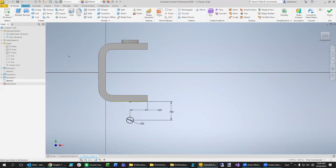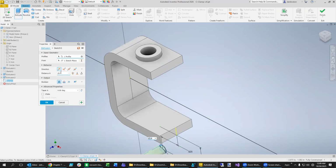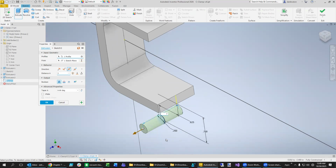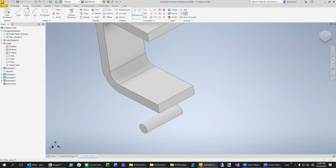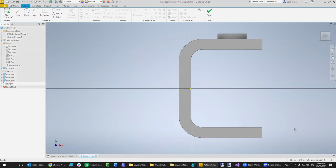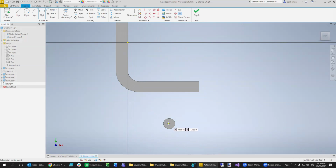We will do an extrude of that tube, that circle. It needs to be bidirectional. It needs to be 1 inch. So it's directly below this. So we put our hanger over the top of this. Now the hanger needs to be supported, or that rod needs to be supported. And in class, we chose to do a sketch on this surface and put a slot from the structure to the rod. The slot is down here, and we'll go center to center, right.